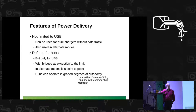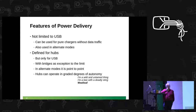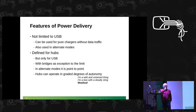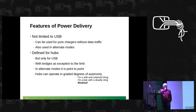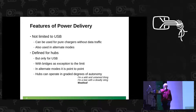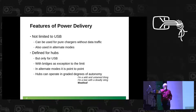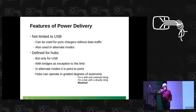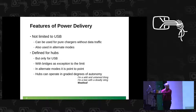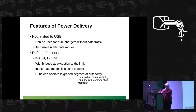If you use it for USB, power budgeting goes down the whole tree over the hubs. If you use alternate modes, that's not the case — with the one exception of USB bridging, which allows you to run a subset of the power delivery protocol to the next level in a hub. The hubs — and that's the nice thing about the protocol — you can ignore the feature. Then the hubs are on their own and must implement a limited amount of power budgeting.